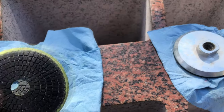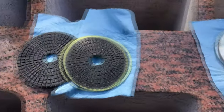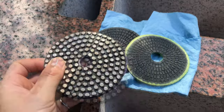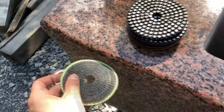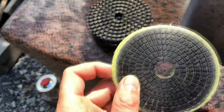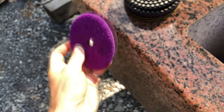After I switched from the heavy metal matrix to the regular pads, I went with a rubber backing pad, and that just allows it to follow any dips easier. The reason I wanted to try one of these metal matrix pads is that at the beginning stages it's really hard on the pads, especially when you start doing edges like this when you're rounding over — as you can see on this pad, it really wears the pads fast. With this metal matrix, because it's nice and aggressive, you don't have to worry too much. And they're thick as well, so you don't have to worry about wearing out the pad as much.